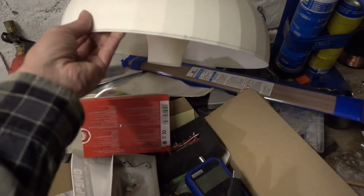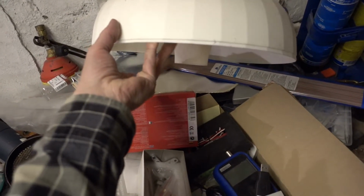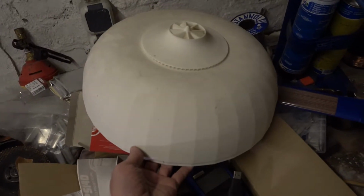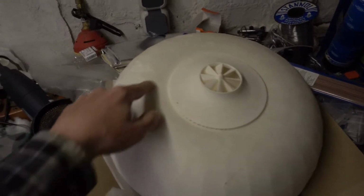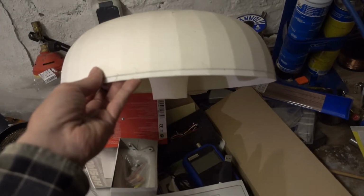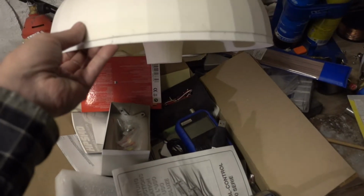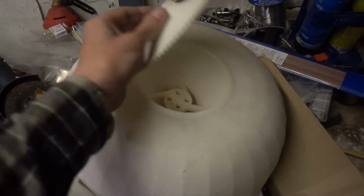and then a two-dimensional hinge and a stem basically for this mushroom, where you can shift the center of mass to fly this thing. But anyway, I will try that first without the rotational compensation. Just put it on a stick, put some weight or a foot that is heavy enough so it doesn't fly away on the stick, and put it on a scale and just see how much lift this can produce.